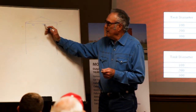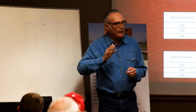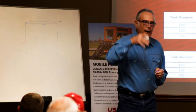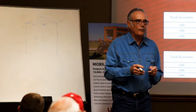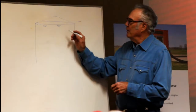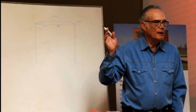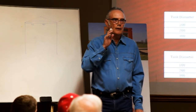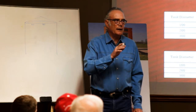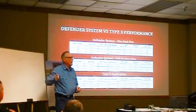I've gone up in aerials and taken a piece of pipe and knocked the expanded metal out so I could hang foam-making equipment off of an inch-and-a-half pipe, or dry chemical to put fire out. The fact is we could redesign this — only because we've been doing it this way, we're going to keep doing it. You young men with engineering degrees who can talk to people in tank design: give consideration to something that either burns out or hinges so you can get foam in.